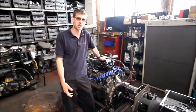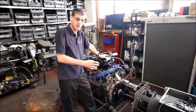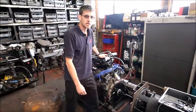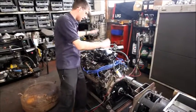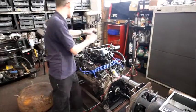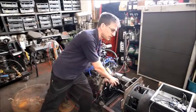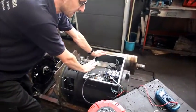It's been quite a while since we've done an update on our Bentley generator project, but we've been in again at the weekend and think we're at a position where we can actually make some electricity. Brief run through what we've got: we have a Range Rover radiator, a Bentley turbocharged six and three quarter litre engine running just on LPG, a Land Rover prop shaft with some custom drive flanges, and then a three-phase 50 kVA generator.